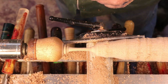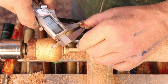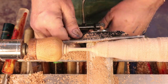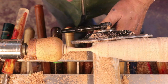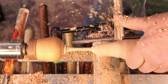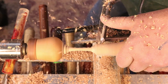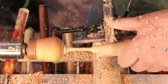Let's take another measurement here — okay, I'm right at 6 millimeters and I may not go down any further. So I'm going to work my way down, keep taking this off; it'll be pretty much the same procedure all the way down. What I'm showing you right now: I'm backing up my stem with my left hand, and I've got my left thumb on the tool. This allows me a reference to where that tool is, and this is really the procedure I use throughout the video as I take that stem down to the very bottom.